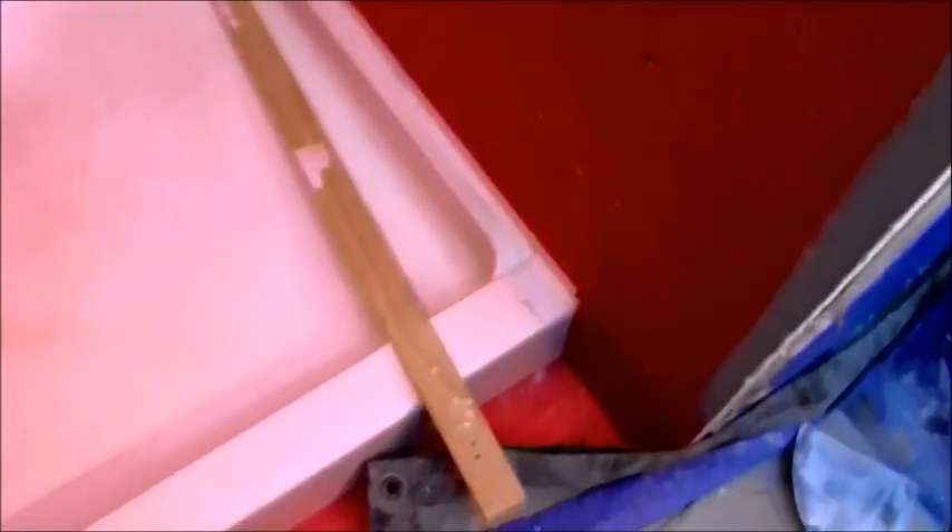He could have cut that out a little bit more of a circle. Overall not a bad job. This was the original fiberglass pan, and I'm not too fond of them. Years later you get all this staining that never goes away — you can bleach it all day and the foot area stays stained. Sometimes they crack, and a thin crack will cause a leak, so I'm not too hip on them.